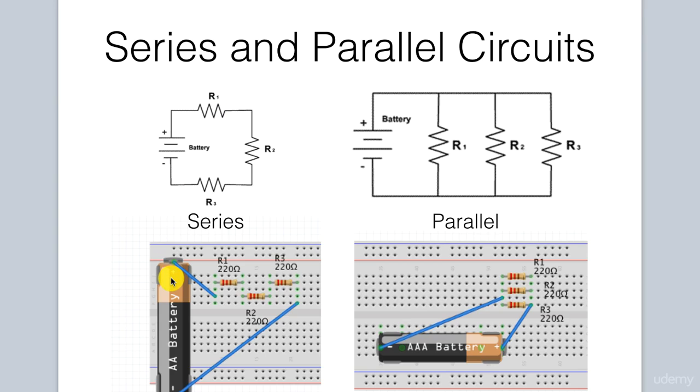On our breadboard, again, here we start at the positive, and remember these horizontal rows are all essentially connected. So if a wire goes to any pin, any hole on this row, it's connected to this resistor. So essentially you are achieving the same concept. Power goes out, it goes into the resistor.